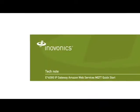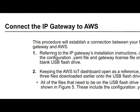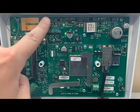After you have edited your files in accordance with the appropriate quick start guide, you now want to load them back into the gateway. This step is similar to extracting the files. Again, we will press the reset button in the top left hand corner and wait for the green power LED to start flashing.